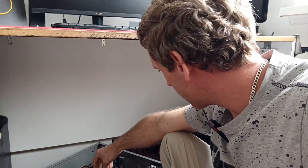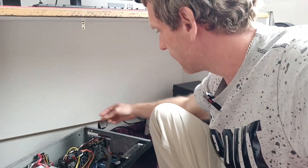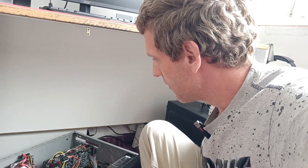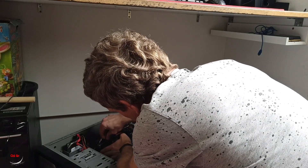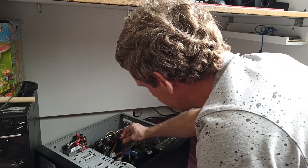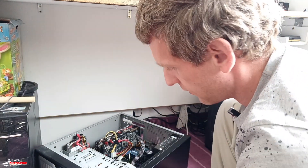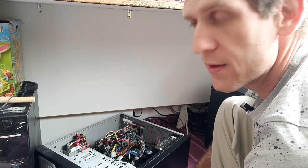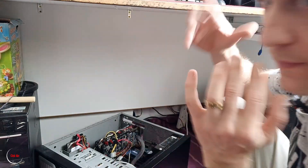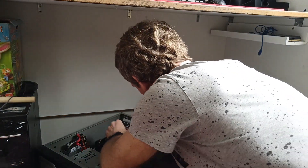We can do one more thing — try plugging just a 6-pin to 8-pin adapter as well, to see if maybe that helps. That could be one way to still use it. Switch off the PC again and plug the 6-pin adapter in. There is still a short even with the 6-pin to 8-pin adapter plugged in. That's how you can test the GPU for shorts and find where the short is.